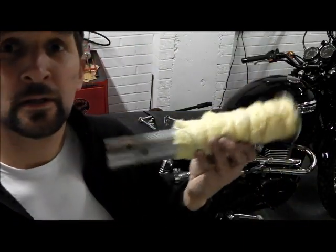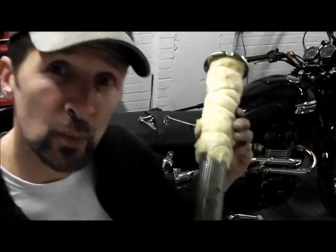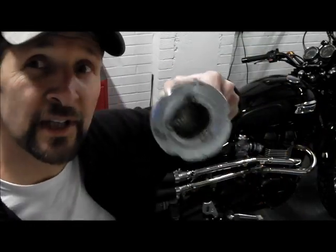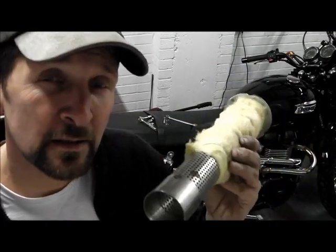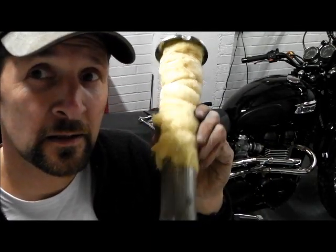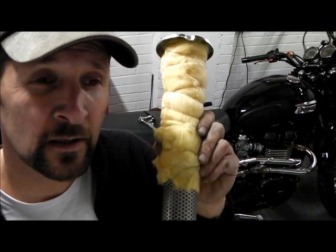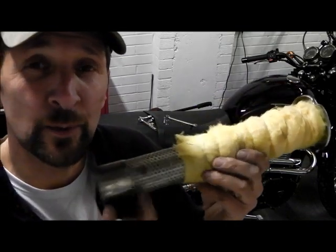Now, received these. These are the baffles from my mate Ian, which go with the pipes, and as you can see, they've got a baffle tube in. So there's four options now. I can do a decibel test with that baffle tube in and the wad in, with it in and without the wad in, and without it in. So you've just got that perforated tube, or with nothing in at all. So there's about four or five different tests.